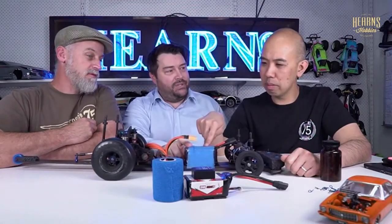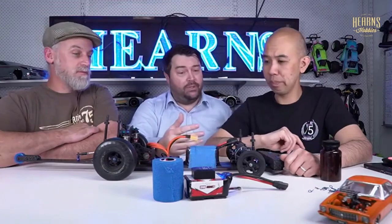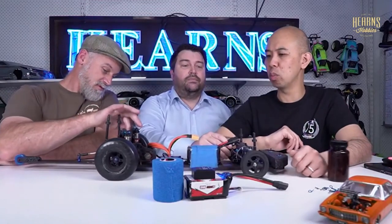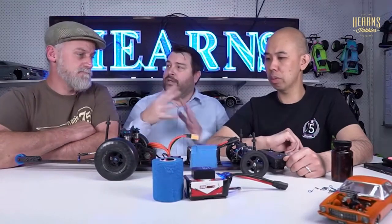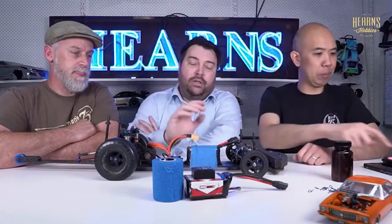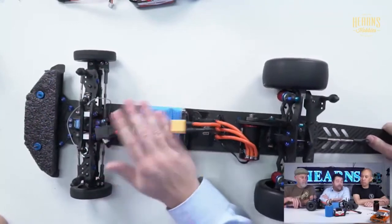This battery at 35 degrees Celsius is probably going to give you 20% more power than at 20 degrees Celsius. That's why the wrap also helps keep it warm. The chemistry works better with some heat in it - the theory is it's crystalline, and as you heat it up it becomes more liquid, giving freer electrons in solution which makes it easier to transmit energy. Heating batteries is really dangerous so I don't recommend artificially heating them - but through using the battery, internal friction and resistance will heat it up naturally, and the wrap will keep it warm.